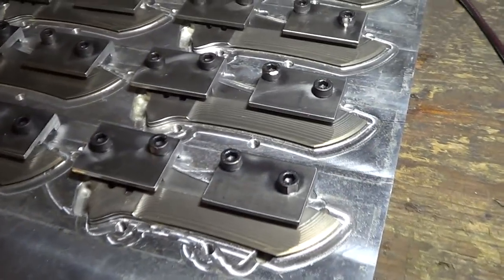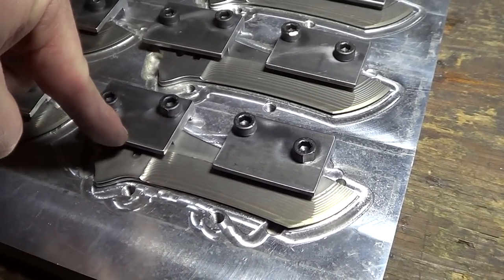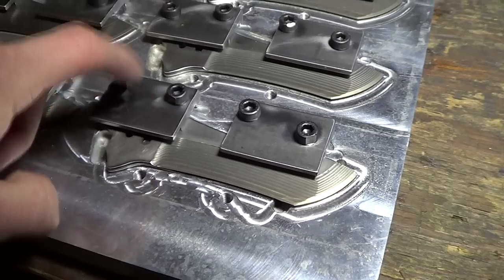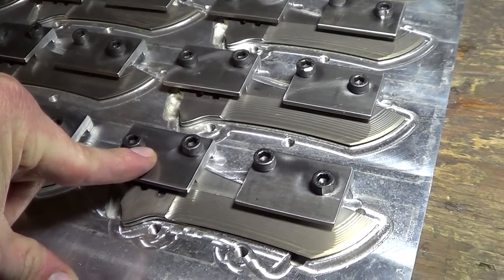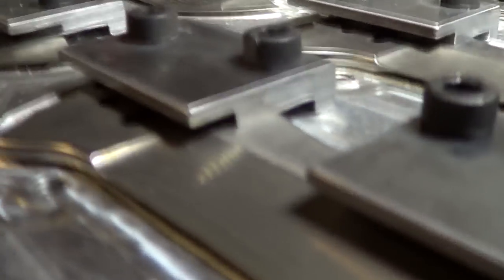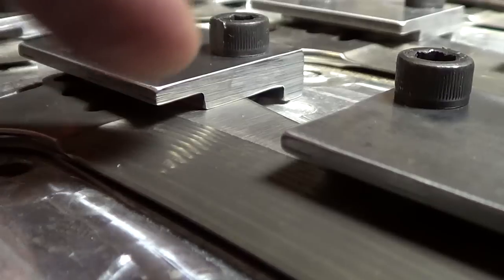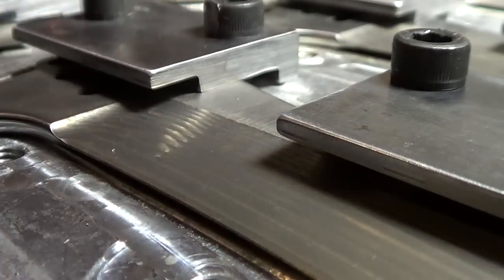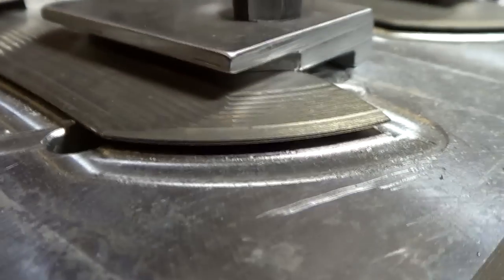When we do final milling on these blades, we're pretty much just going to be using this clamp and maybe a screw through this pivot, or another little clamp on the side or something like that, but not this big one, I don't think. Maybe. Because as you can see, the step underneath the clamp is extra material. Like this hole between my fingers right now is extra, and that's going to be cut off. But yeah, so it might actually work to have both clamps on there.